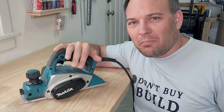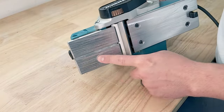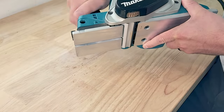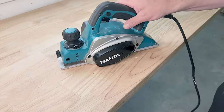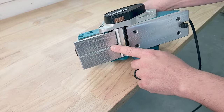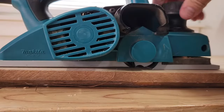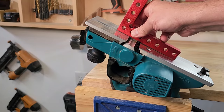Let's talk about some of the basic parts of an electric hand planer. If we flip this thing over, the first thing we'll see is this movable front shoe. If we turn this dial right here, we can adjust the depth of cut. Turning it clockwise will take more material off; turning it counterclockwise will take less material off. You may also notice that the front shoe has a V-groove cut into it — that's to make quick chamfer cuts, and I'll demonstrate that later. And back here we have the fixed rear shoe. It's the difference in height between the front shoe and the rear shoe that determines how much bite the blade has.